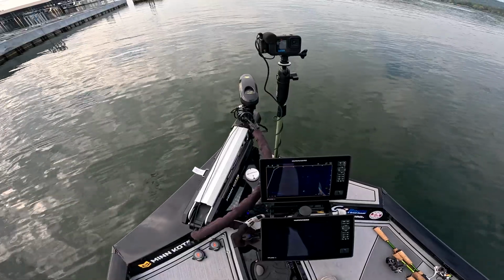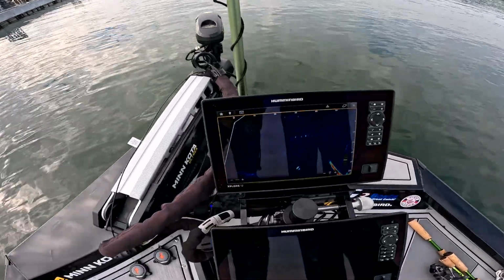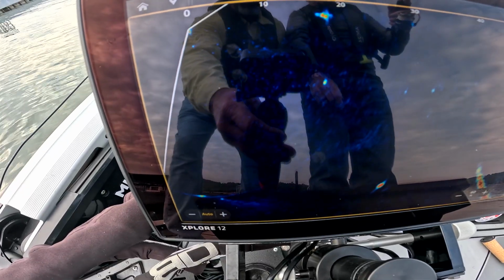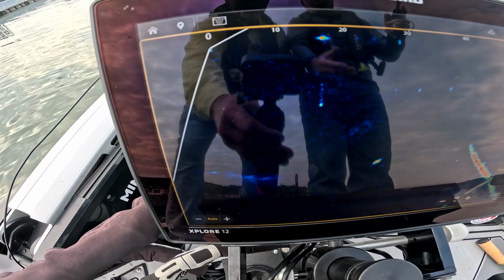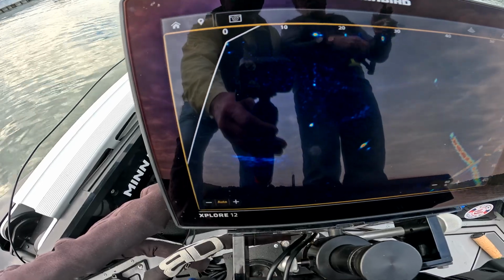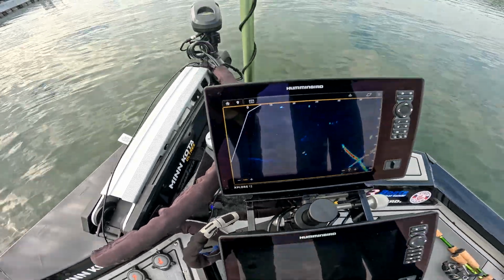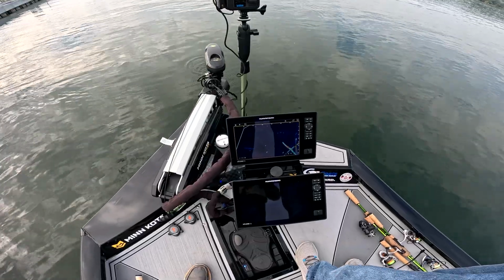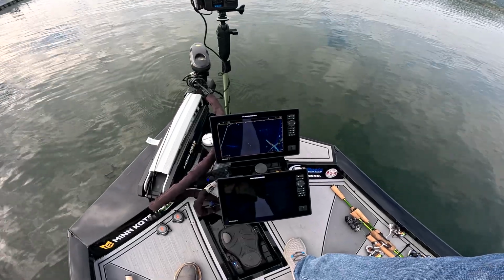You're going to take your bait, just pop it right out in front of us, just about 5 or 6 foot, and watch for the mark. So it's pretty close. You can actually see the splash. Yeah, and that's what we're looking for to start off with, which we're pretty good. We're pretty much straight on the shaft right there. If the shaft or the trolling motor transducer is not straight, what will happen is you'll get the splash, and as it drops, it's going to come off the screen.